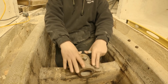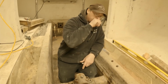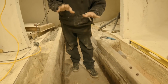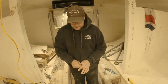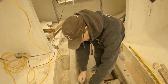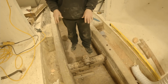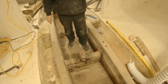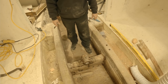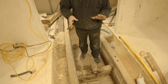So we'll have a babbitt bearing here, we'll have a babbitt bearing in the back, about where the one is now, and then we also have the shaft packing in the back. All of these areas need to be accessible, and so our shaft alley will be sealed, and in these areas right here we'll have a hatch that you can remove, a watertight hatch that's simple and easy to remove. Once again, very standard in our fishing industry, so there's no weird thing going on there.